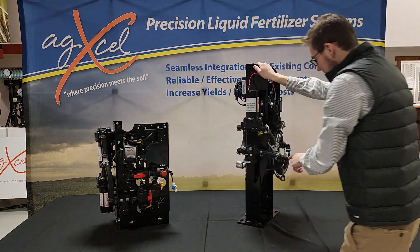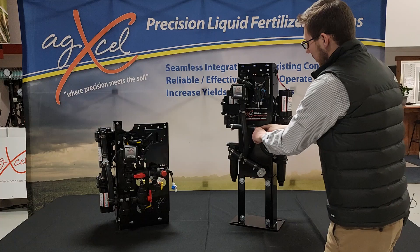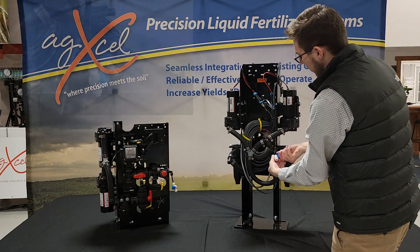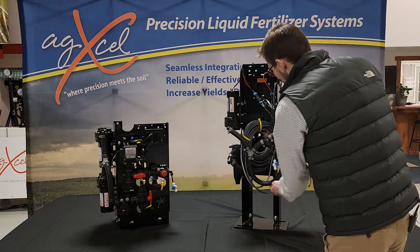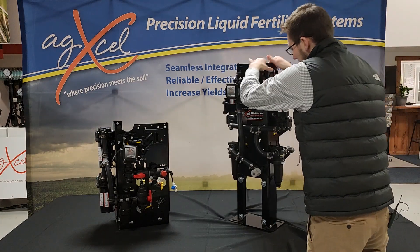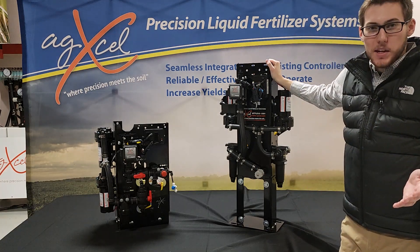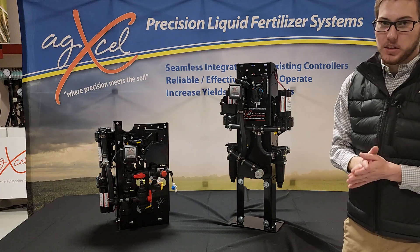On this system, we'll just start at the inlet — three-quarter inch hose barb — then we will come into a 50 mesh filter on the inlet. We will then come out of the filter and tee off into both of the pumps — the same kind of 5.3 gallon per minute electric pumps that we have on the GX2C. As we come out of the electric pumps, right here will be your bleeder valve. So again, if you're having issues with air getting in the system, open up the bleeder valve and you can help get these pumps primed even faster. Coming out of the pumps, the bleeder valve will come in through an 80 mesh filter on the outlet side. From the 80 mesh filter, this will be your adjustable valve, similar to the red one on your GX2C pump. Just loosen the locking nut and then you can open your valve. Would only recommend opening this if you're doing some sort of agitation — wouldn't use that to lower your pressure. Try to switch out your disc orifice or your microtube at the row; that would be the better option for lowering your pressure.